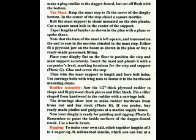Assemble the daggerboard trunk with waterproof glue and screws or galvanized nails. Set the trunk in the dinghy bottom, centering it immediately in front of the seat supports, and mark its position. At this point, the bottom curves slightly. Shape the lower end of the trunk with a rasp and sanding block to conform to this curve. Then fasten the assembly in place with screws driven through the dinghy bottom into the trunk cleats. Use rubber-based sealing compound in the joint.